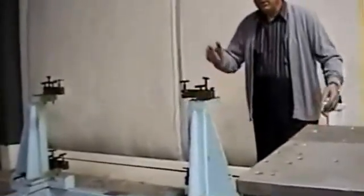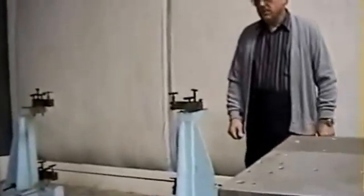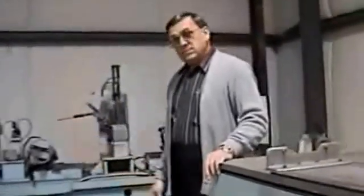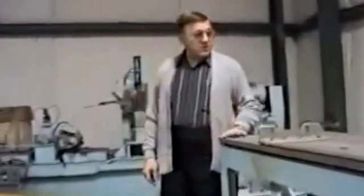Who cares, theoretically, if the fuselage is slightly twisted? But the important parts are located by tooling holes, pre-drilled holes properly. That's the horizontal stabilizer, the vertical stabilizer, the wing, and the engine. The fuselage can be any shape as long as those 3-4 things are right. In theory, yes.